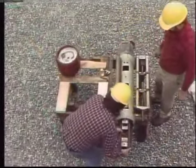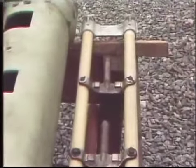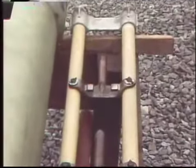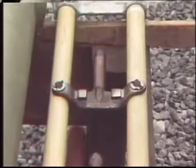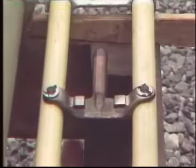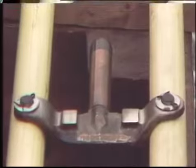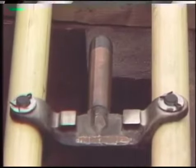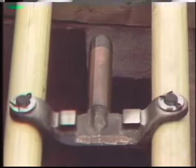The contacts are an especially important check in any breaker inspection. There should be very little wrong with the main contacts, since it's the arcing contacts that break the circuit and are subject to arcing. If main contacts are burned, pitted, or charred, they may not be separating before the arcing contacts — damaged main contacts may need to be replaced, and the open and close sequence of the contacts may have to be checked.